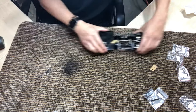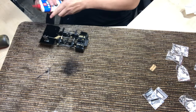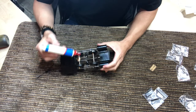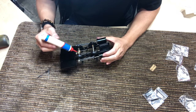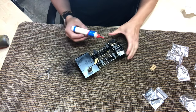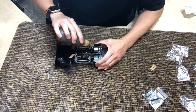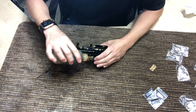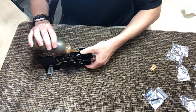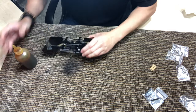Feels pretty smooth, first time. You want to make sure you have your moving parts oiled. I like to put a little drop on the bearings on the axle, a little bit on the eccentrics. I could do a little bit of steam oil even on the valve, and on the piston, so that when it goes in it brings a little bit with it — because while you're testing it on air, you're not getting much steam oil in there.